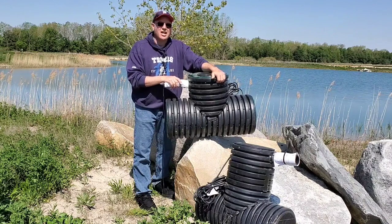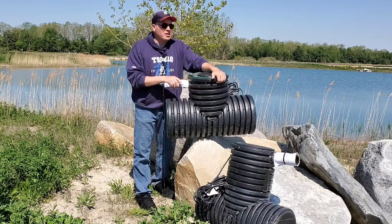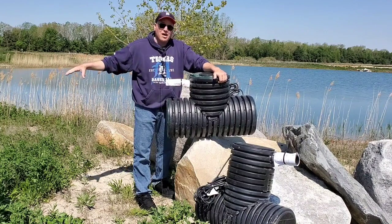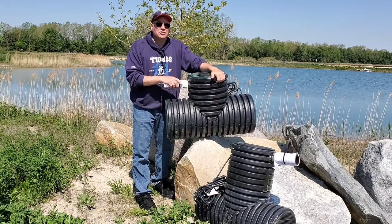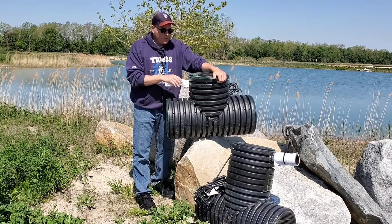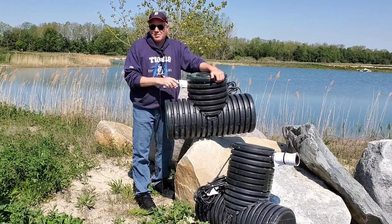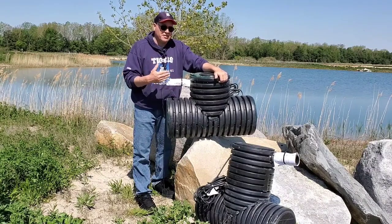People will say, God, I thought I heard it running quite a lot this week or the last couple of weeks. Seemed like it was running all the time. Well, that's because it was. The check valve went bad. It pumped the water out. The water, you know, backflowed back in. And that continued until all those life cycles got used up and the sump pump was taken out. So this takes care of the two things that are most problematic when it comes to sump pump life.